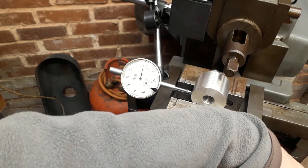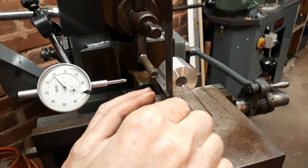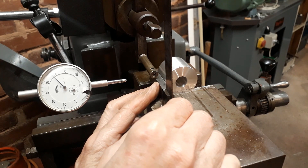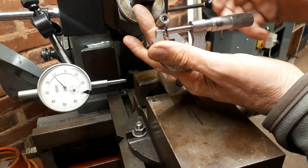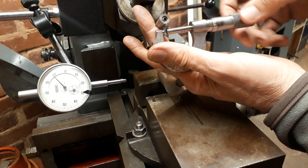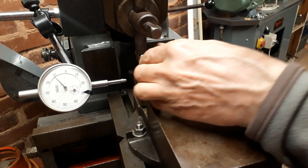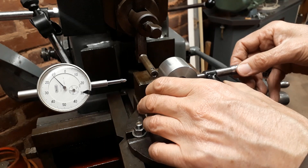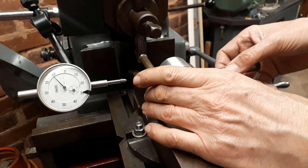The next thing I need to do is find the edge of the bush. I'm doing this by just putting a spacer in there with a known thickness — a feeler gauge — just to mark off the edge of the cutting tool. I'm measuring the width of the cutting tool and then we'll be able to traverse the table across to get one edge of the slot. The cutting tool is actually narrower than the slot so I'm going to have to take a couple of passes to get the full width. I'm also measuring the outside diameter — a little bit of arithmetic and we'll know how far to traverse it. Unfortunately my clock only has half an inch of travel so I had to take it in two bites to get the necessary distance.